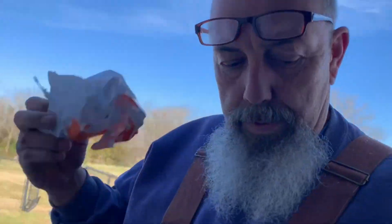All right, let me just throw this away. So there's a little tip for you guys. Don't have to use gloves or anything. Just grab some of the roofing paper or whatever you're using, tie back and stuff. And then you get a nice good seal because you just press as hard as you want and it'll spread it all in there. Get right behind it and cover it.